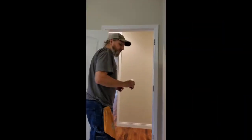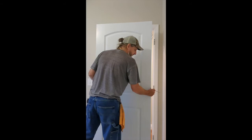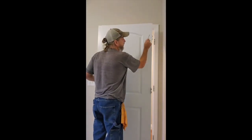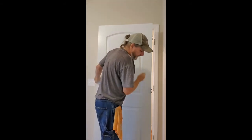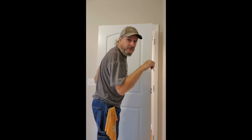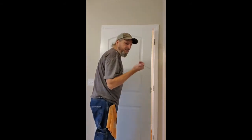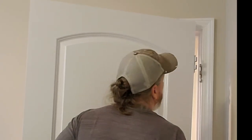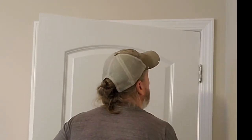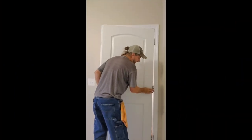The room's all painted and you're ready to put the door back up. Make sure you've got one of the pins in hand — I always have it in my left hand ready to go. Grab the door, get it close to position, and concentrate on lining up the top hinge to the top hinge on the frame. I don't care what's happening with the rest — just line those up, get your pin started, and then the rest will fall in place. Grab the door handle with your right hand, take your index finger and put it right underneath the middle hinge, and lift the door up. Concentrate on that top hinge and get your pin up there — that's why you want it in your hand ready to go.